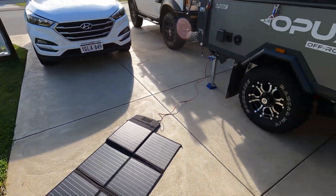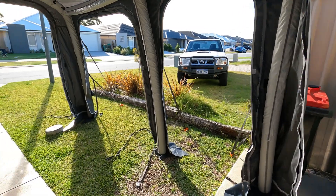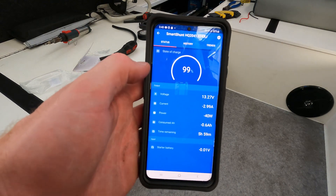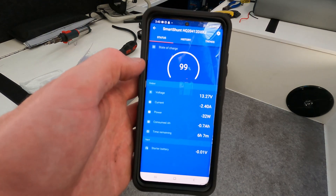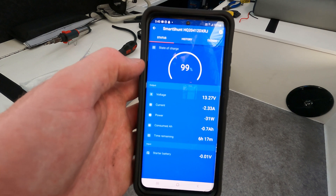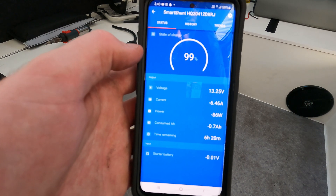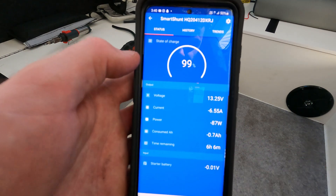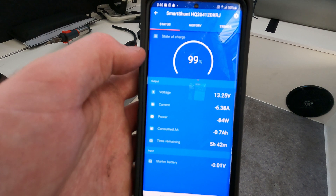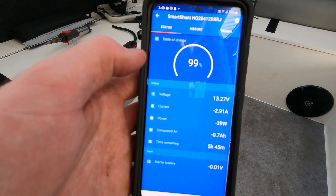That's the solar panel plugged in there — pretty sure it's only 120 watt. I'll go inside and open up the app on my phone and see what she's doing. So that's the solar panel plugged in at the moment. I'm still on negative 4 amps — when my fridge is cycling it draws 6.5 to 7 amps, so currently getting about 3 amps into the system. Just to give you guys an example: Kerry, turn the solar panel away — now it's going up to negative 6.5. And then shine it back in the sun — there you go, you can see the panel working there. So we're using about 3 amps at the moment.